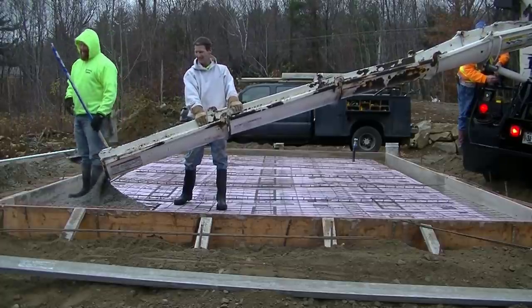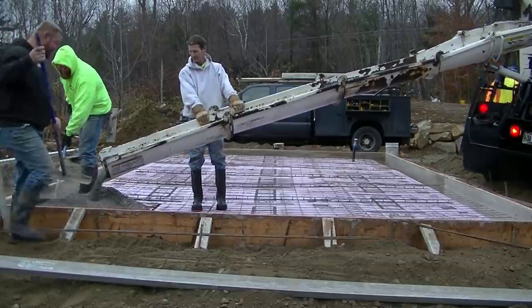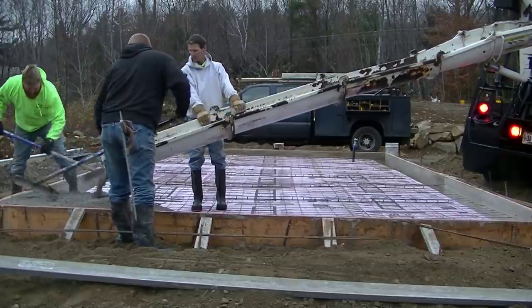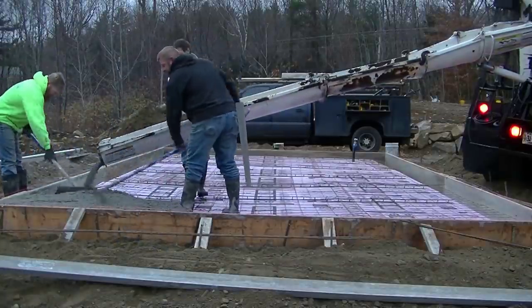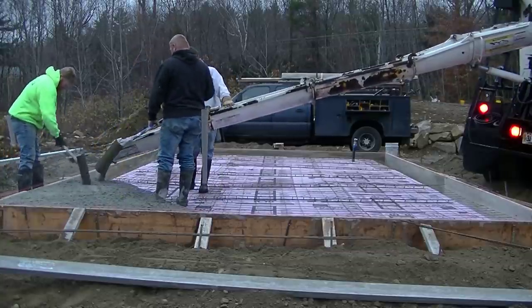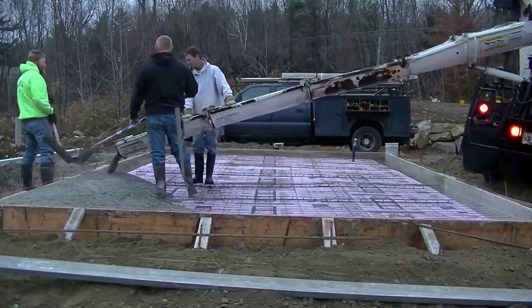We formed all this up. It's a six-inch thick concrete slab, and the edges have been thickened to 12 inches, which we used a 2x12 for. We put styrofoam down under the slab to help keep the floor a little bit warmer. We've got wire mesh for reinforcement and slab bolsters under the wire to help hold the wire up into the concrete.